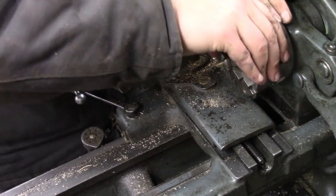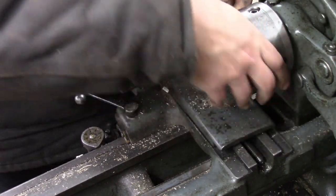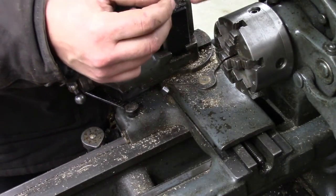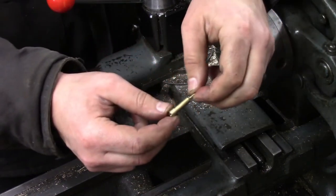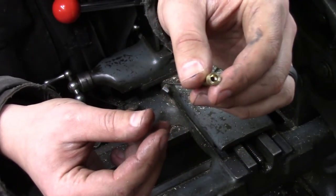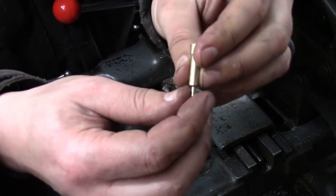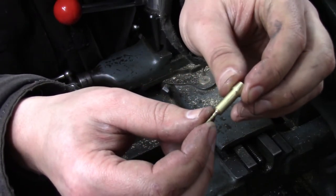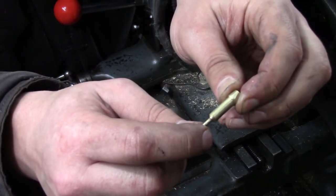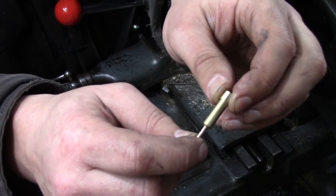That about wraps it up for this piece. So for the turning work anyways, got the hole through there, got the counter bore, the hose barb done, hole end there. So the only other thing that needs to be done on here is put this on the mill and put an intersecting hole at the right spot to transfer the gas propane into the body of the burner. That'll be a job for another day.